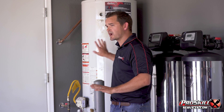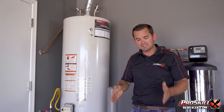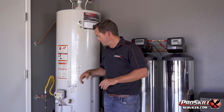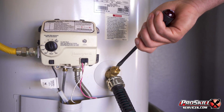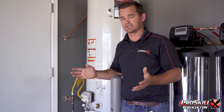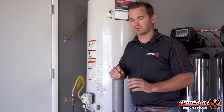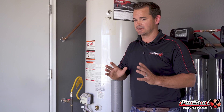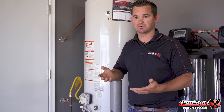We're not going to drain the heater entirely — we just need to flush it out and examine what's at the bottom. One thing to note: the material the valve is made of is very important. This one's brass, as you can see here, and that's great — you're not typically going to have a problem with a brass valve. However, a lot of older heaters have plastic valves that can absolutely blow up in your hand when you try to turn them. So if you have a plastic valve on an older heater that looks crummy or like it's been leaking, that may not be something you want to touch.